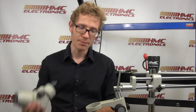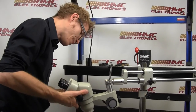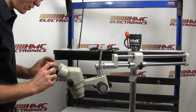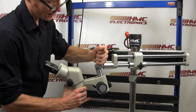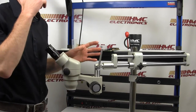You're not hunched over as you try to do your inspection. You've got plenty of room to sit back and see clearly what you're working on. So let's finish up assembling. I have now attached the 23750, kept my grubby little paws off it, so I've got a nice clean image. Set screw holding this in place. Drop in my super wide field lenses so that I can see a super wide field. When you are setting up a microscope, there is something called par-focaling.